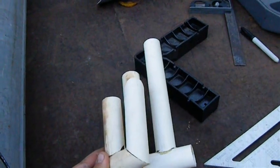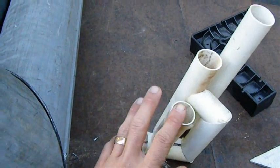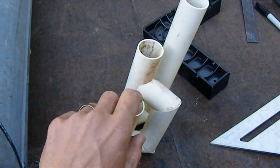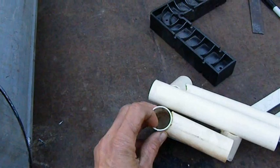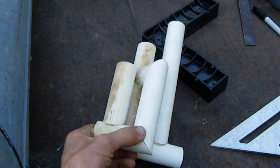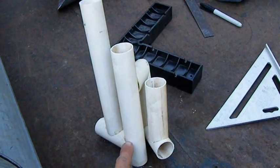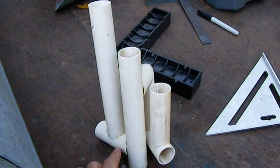This is all going to fit inside that container, except for this piece here which is the chimney. These three will be inside and insulated, surrounded with insulation. This first one is the fuel cartridge — sticks, branches, and stuff will go in there, and there will be a lid to keep it airtight so it doesn't burn in the wrong direction. Down here is the air inlet and the burn chamber. This is the updraft tube, updrafting into this middle one, which is going to be the heat exchanger chamber. The gases come in, flow down, and then out to the chimney. This is just a clean-out so I can clear any ash that builds up at the bottom of the chimney.